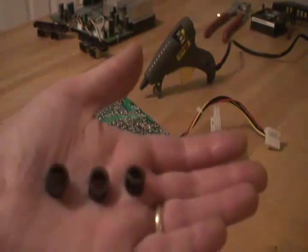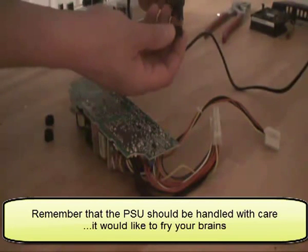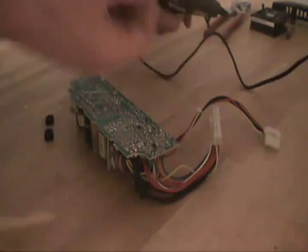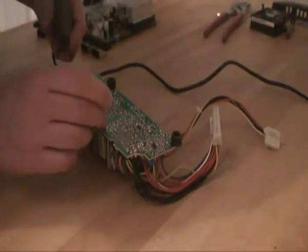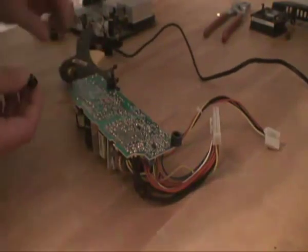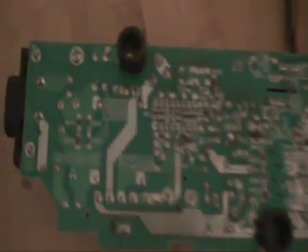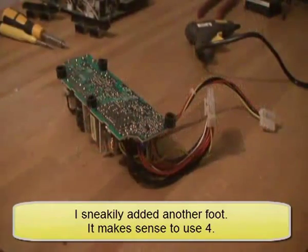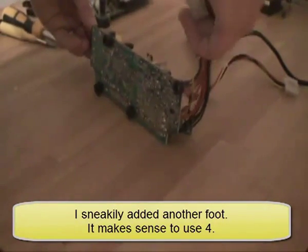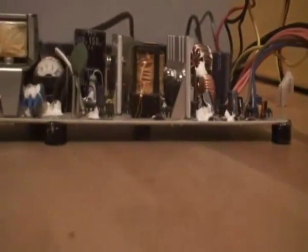Do the same thing with the PSU. This time we are going to use these little feet that we made ourselves. A bit of glue on here and then we will find a convenient spot to stick them down. On the PSU there are a couple of holes where the original screws went in — that is where you want to put these. The reason I am using these here instead of the brass mounts is we can get a screw through this hole to secure it down. There is no hole there but we only need two screws on this. The feet make this sit nicely off the surface.